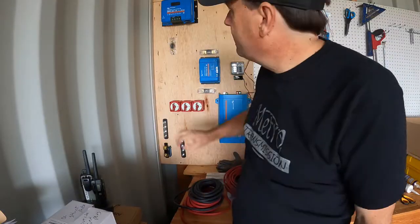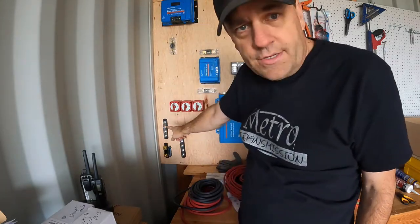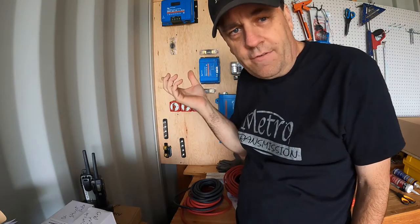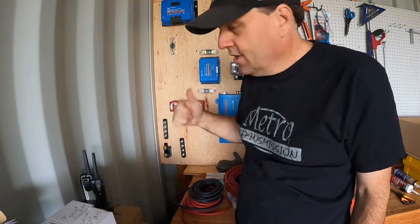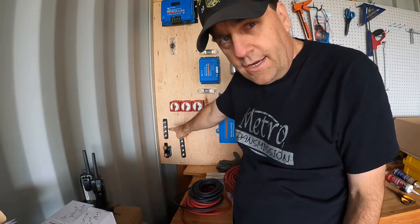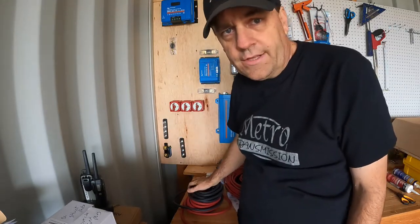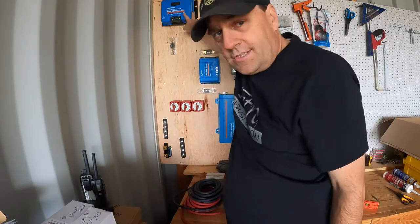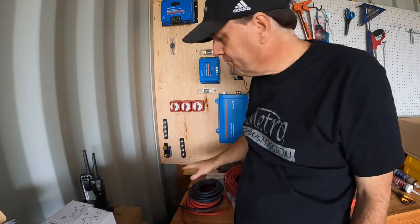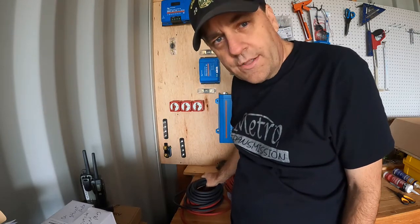Back to work. I'm going to use some super meaty wire from the charge controller through its fuses down to the bus. It probably doesn't need that gauge for the distance, but I have enough of it and it can't hurt. It is the highest amperage section, with the exception of the connection from the bus bar through the shunt down to the batteries. I did the math and two gauge is good for that, so we'll use two gauge all the way up, and everything else I'll probably use six gauge. Got to get out the special tools for crimping giant copper lugs onto these things, because they're huge.